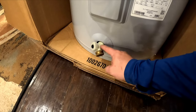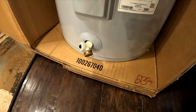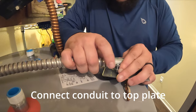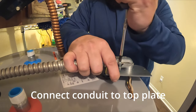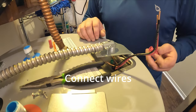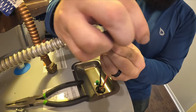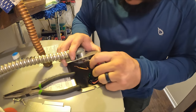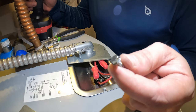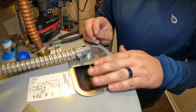I would highly recommend replacing the plastic valve with a brass one - they didn't have any in stock at Lowe's so we may come back at a later date and swap that out. We're going to use the same wire nuts that came off the old one - they'll work just fine. We just want to make sure they have a good secure connection. We're going to do black to black and white to red - however, this is 220. Tug on them to make sure they're nice and snug, push all the wiring down, then connect the ground to the green screw. These top plate screws are a quarter of an inch. I always like to check my wires one more time before I put the plate on just in case some wires got loose.